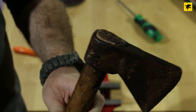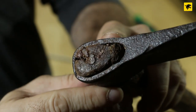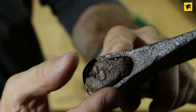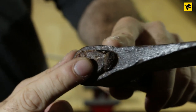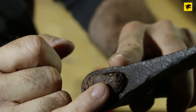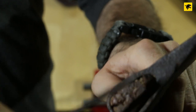This is the axe, and the first thing we're going to do is take off the handle. This is the head of the handle. There is a cylindrical piece of wood inserted to expand the wood, and we can see there is another wooden wedge which secures the handle a bit better. This handle is quite old, so it should be quite easy to take it away. We can use a screwdriver to move it and then it comes out very easily.